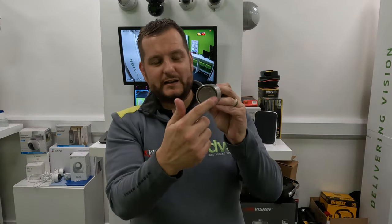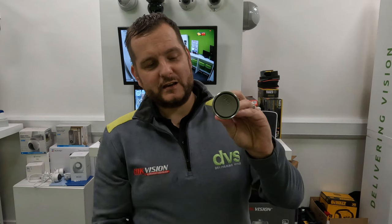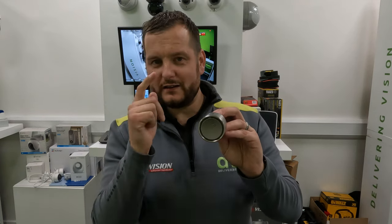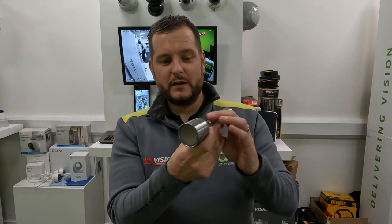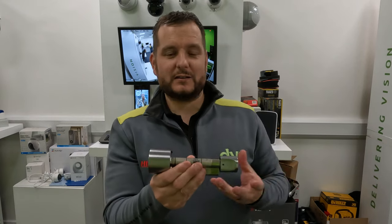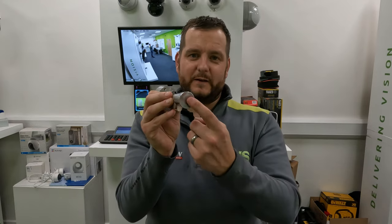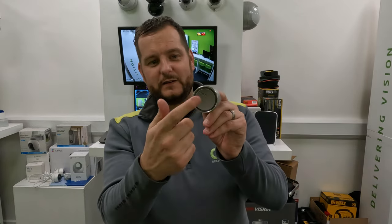This element — the bold mechanism — that's the touch sensor. If I press that, you'll see it lights up and goes green. This mechanism is fitted on the inside of the door, not the external side. The lock can be used on an external door — that is not an issue — but make sure this cylinder is fitted on the outside and this mechanism is fitted on the inside.